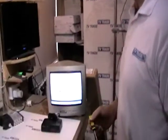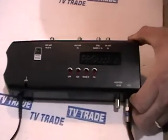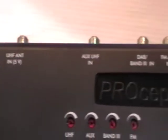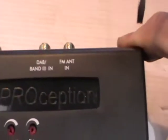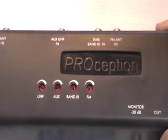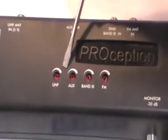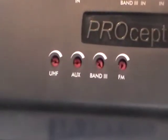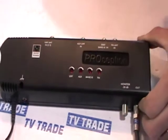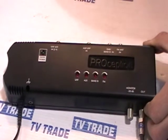I have in front of me here a head-end launch amplifier. The purpose of this launch amplifier is two-fold. The first is to strongly boost the signal so it can be distributed to up to about 100 different TV points. The maximum gain that we can set for each of the different inputs — each controlled independently — is between 32 dB and 39 dB. The second purpose is that it combines four different inputs so they can be fed through a single cable.